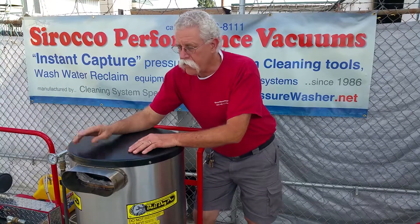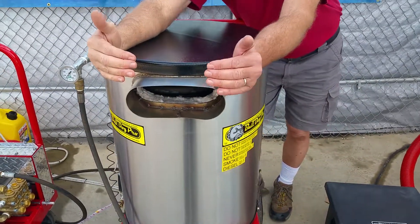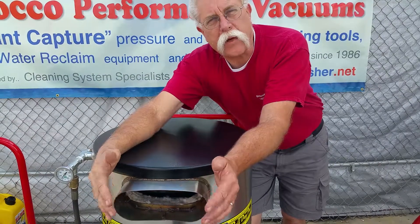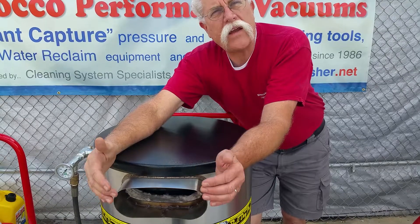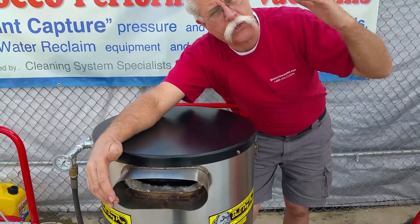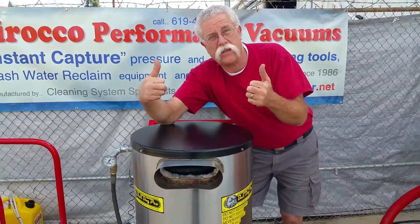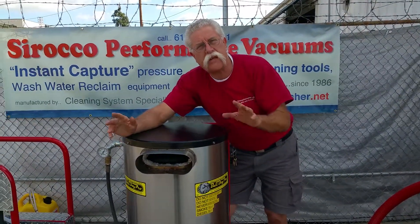This is going to have a shroud on it directing the heat up. We're having these made out of stainless steel — we don't want somebody standing in front of this thing to get a blast of hot air, but we don't want rain going in either. When these heaters are mounted on a trailer or a truck and you're in parking garages, instead of directing the heat up into the fire sprinkler system, we're directing it out sideways.